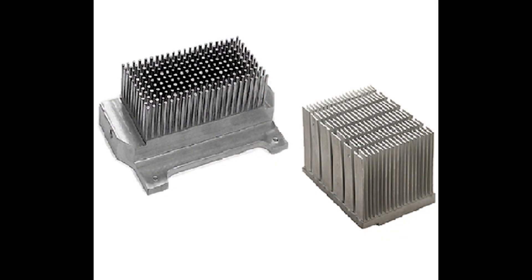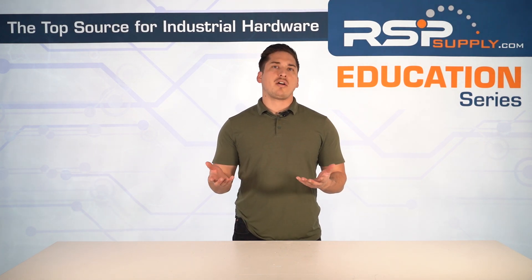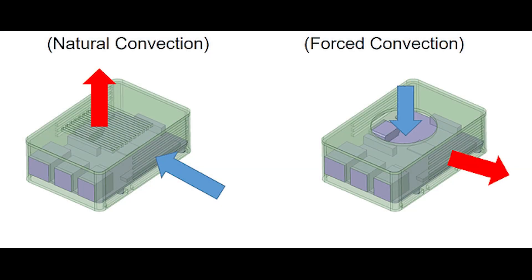There are a few types of heat sinks. You have passive heat sinks — natural convection — which are basically a finned structure made out of aluminum or copper that dissipates heat using ambient airflow, whatever is naturally flowing through the compartment. This is suitable for low and medium power soft starters. Then you also have active or forced air cooling, involving fans or blowers, which increases cooling efficiency for higher power applications.